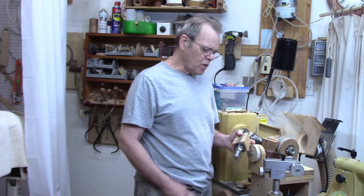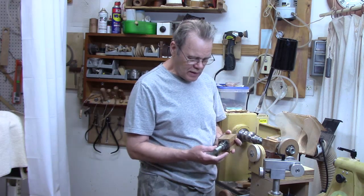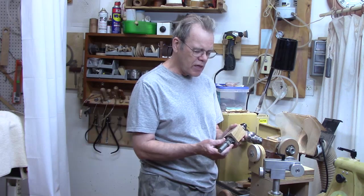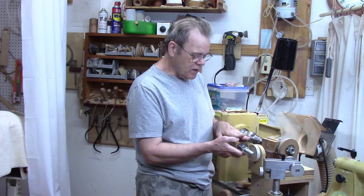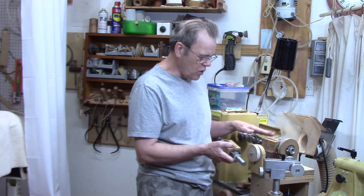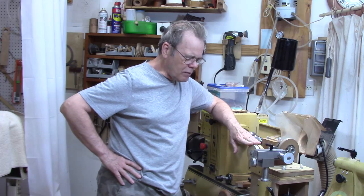After using this shop-made jig for a while, I was never really happy with it. The soft zinc-coated thread seized up on the 16-threads-per-inch screw and rendered that side useless. Even though I had interchangeable arbors, it still works with the 10-threads-per-inch, so let's talk about the options for buying commercially.